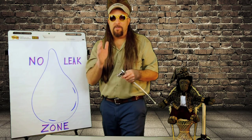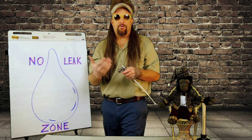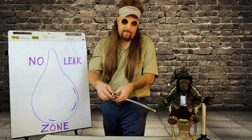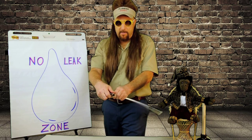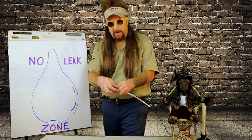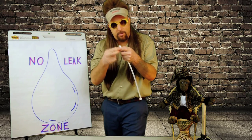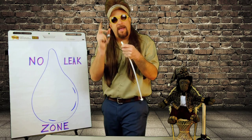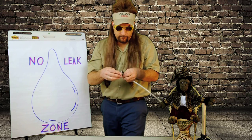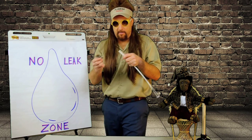Chimpanzee strength will be sufficient. Some PEX lines have built-in gaskets on one end, which, because it effectively acts as a ferrule, makes them easier to replace than traditional PEX lines. You will tighten it to where it's real snug. The way that you can check to see if it's where it needs to be is when you take it back off and that little ferrule is captured — meaning it's compressed down and captured, and it ain't going nowhere. Then that's enough. If you put it in and it comes out just like that, that ain't enough, so you got to go tight enough to end up capturing that little ferrule.